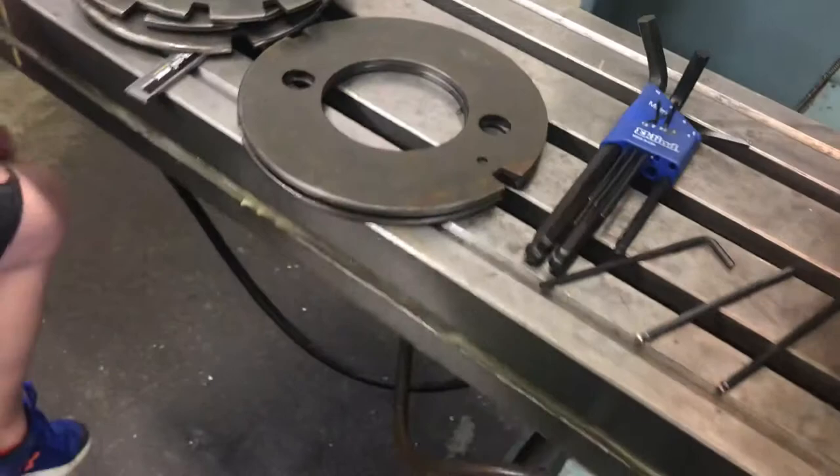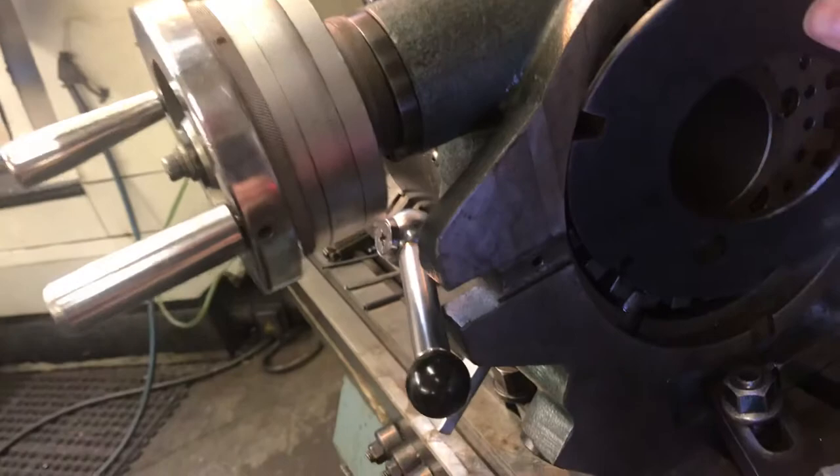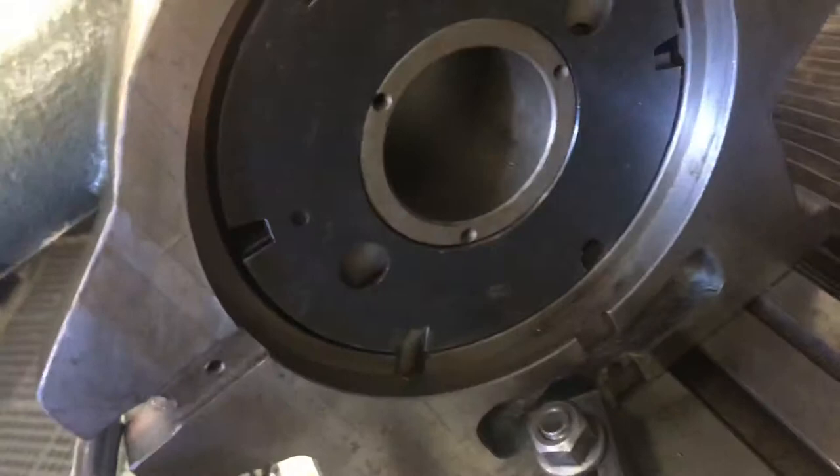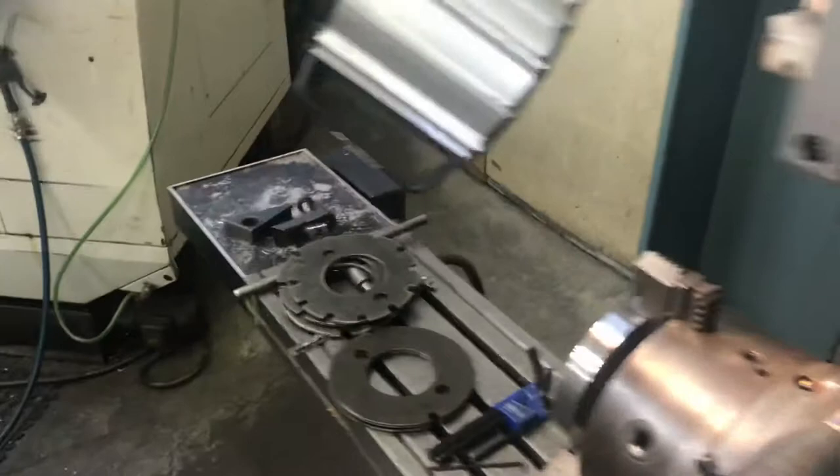In our case, we're doing this one right now, and we'll put this gag plate or masking plate up in there. Set that in there and position it so it is over where the locking mechanism is right there on the bottom. Then to hold that in place, we've got a cover that bolts up on there to hold the masking plate in position. I'm not going to do that right now just for the sake of time. But if you want to do cuts where you're indexing rapidly, lift up on this handle, then you can manually turn the chuck and it will lock into the next position — and this thing here locks positively into different positions where the masking plate has the gaps in it.